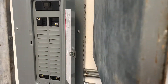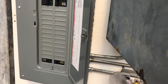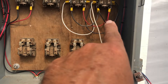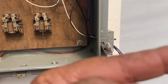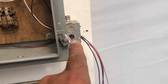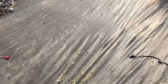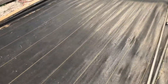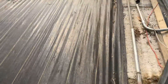We've got our first thermostat — it's 120V, single pole single throw, for cooling. One leg goes out all the way to the thermostat and the other leg — the neutral, actually the hot — comes back, and we got that junctioned up. Everything on the thermostat is turned up above the current temperature.